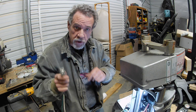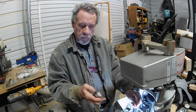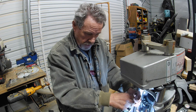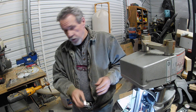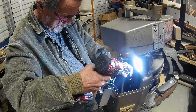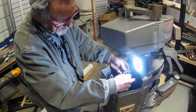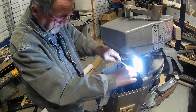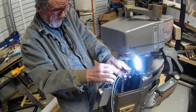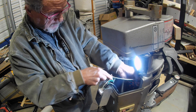Okay guys, I'm fixing to wire up this reverse switch on this total shop that I'm rebuilding. Here's my red and my black going to my motor, and like I told you, I'm going to hook it to these two center terminals, and these two are going back to my rectifier to get my DC voltage. So let's get these put on and we'll have this thing put together. We're going to put one on one side and one on the other, and it don't matter which one goes where. Tug, tug, check, check, check, check. Okay, these two are my hots that feed this switch. We're going to get the switch and shove it in the hole it goes in, fish it up there, and work our way back out.